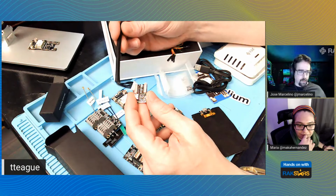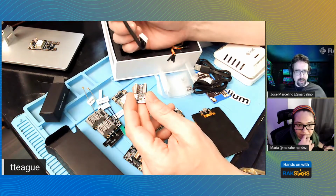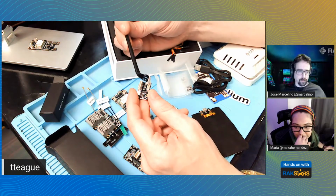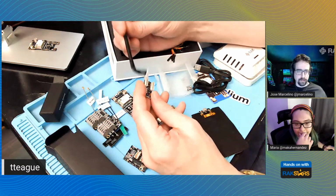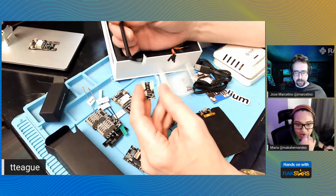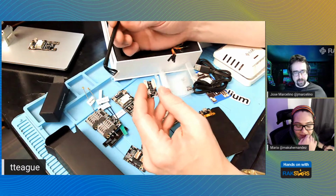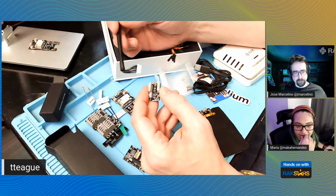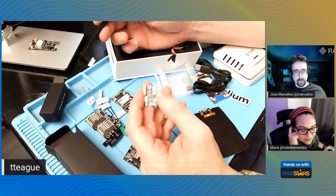That's the idea of that module. And each of these is a little different. So both these aren't identical ports here. That's right. But there is full specifications on how these break out. And, like you were saying, you have UART, I2C. There's a number of ports that break out here. And what I had done on my prototype box is just to put these off into screw terminals. And so it makes it very easy just to throw a testing sensor or whatnot.